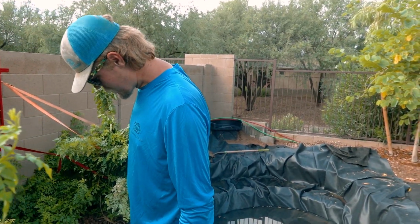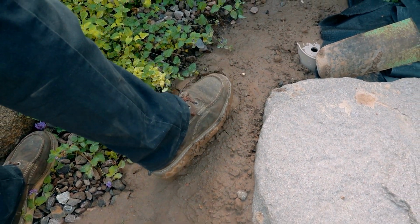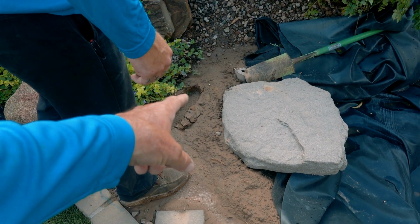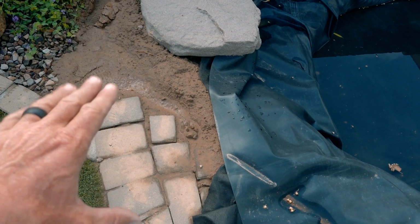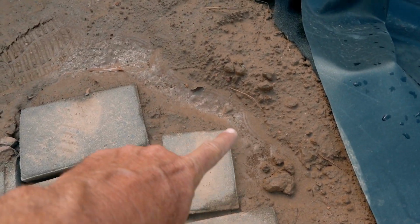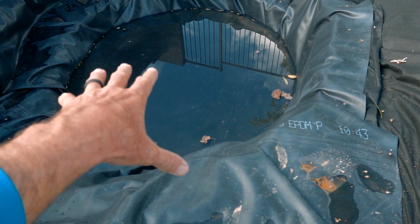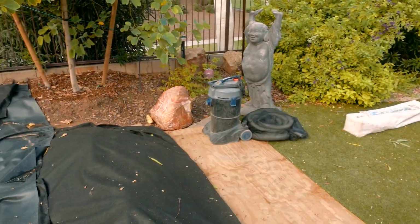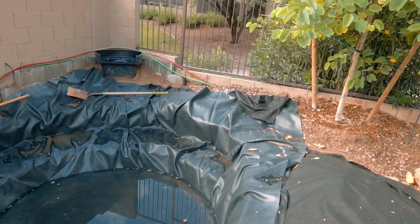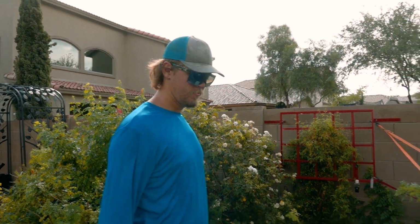Jaren. Don't step there. There's a reason why we put that berm there. So all the water that made that muddy didn't end up under that liner. So you can see what our efforts did. It prevented that water. You can actually see where it was pooling right here. I did not want water going under that liner. So we do have a pool in the bottom of the pond, but that's cool. It's on top of the liner. We'll use our vacuum, pump that out right over and through the fence, and we will have fairly dry conditions to work in.